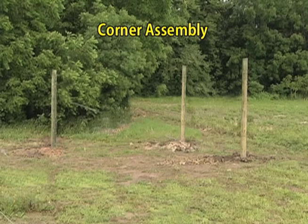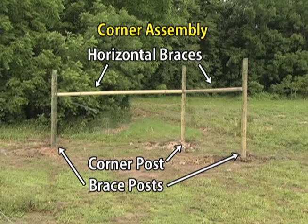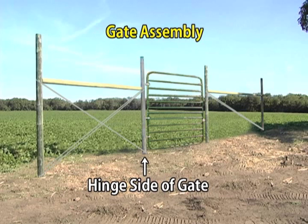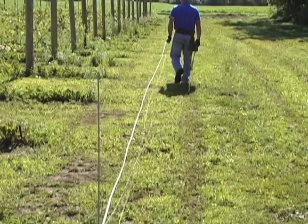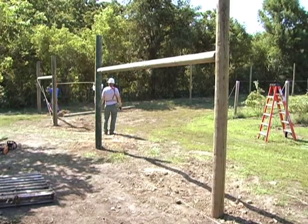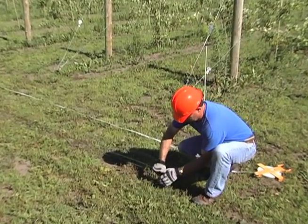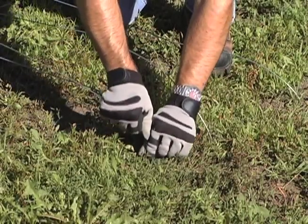The next step is to install horizontal braces and wire bracing at your corner assemblies and gate assemblies. A corner assembly will have a horizontal brace on each side of the corner post and wire bracing from the top of both brace posts to the bottom of the corner post. For gates, you'll also need a horizontal brace on each side of the gate as well as wire bracing. On the sides of the gate where hinges will be attached, there need to be two sets of wire bracing forming an X. Begin by spooling out 80-foot lengths of wire from the spinning jenny — these will be wrapped diagonally between the posts that have horizontal braces. Poke the ends of the wire into the ground to keep them from tangling or coiling up. You'll need one wire for each side of a corner brace, and if you don't hang your gate on a corner assembly, you'll need an extra wire for the brace assembly where you hang the gate.